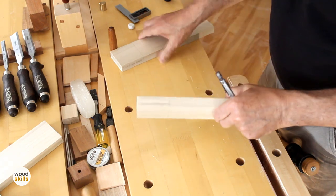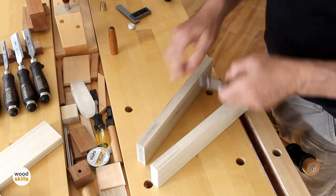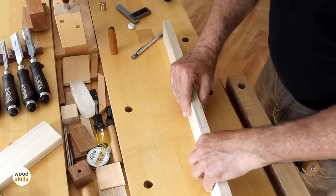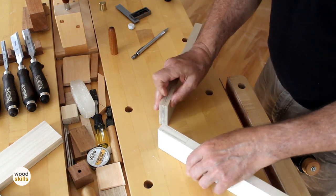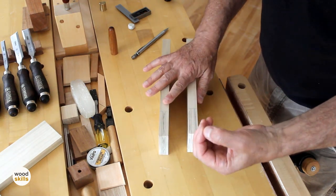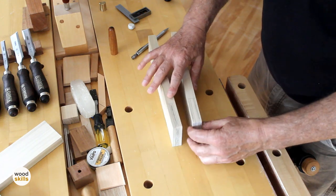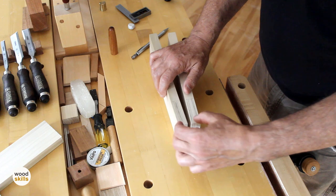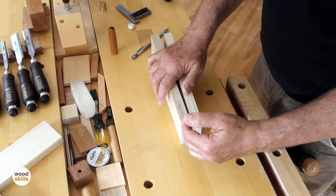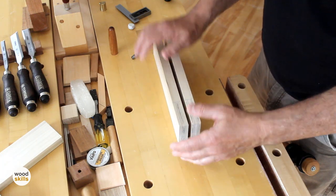So that's the tenon, and this is the mortise, and they fit together. And the premise is, because there is a kerf involved, I'm going to be sawing using a Japanese Ryoba saw for the most part. And because there is a kerf, a very small 1/32 inch kerf, for example, I need to allow for that in my measurements. So I've created two different spacers to offset the female portion and the male portion, and I'll give a demonstration of that next.